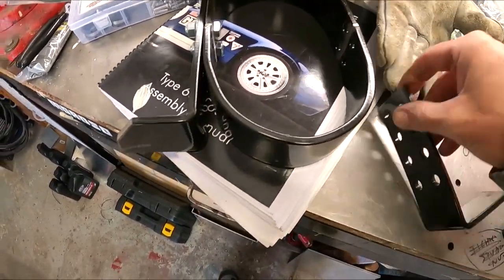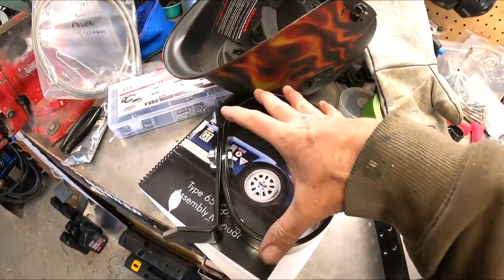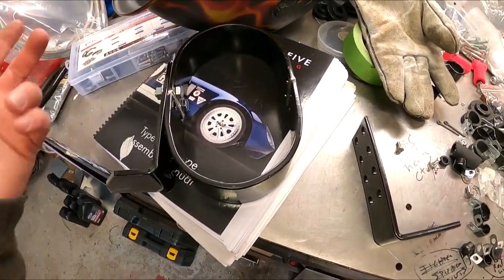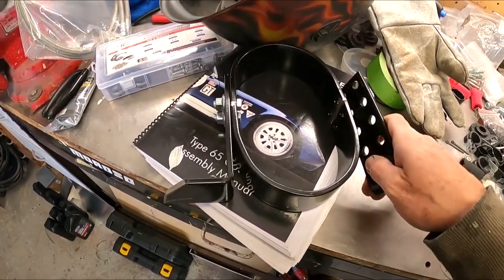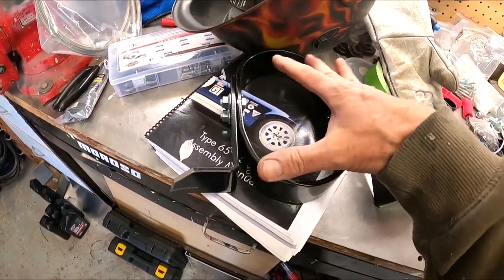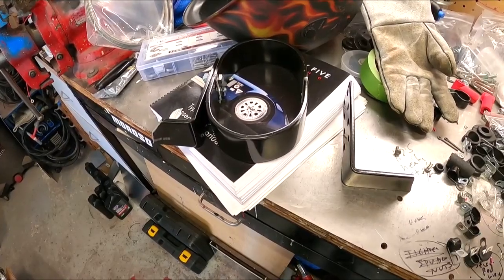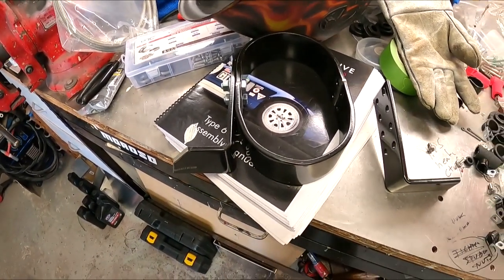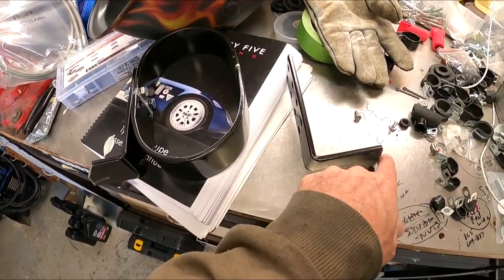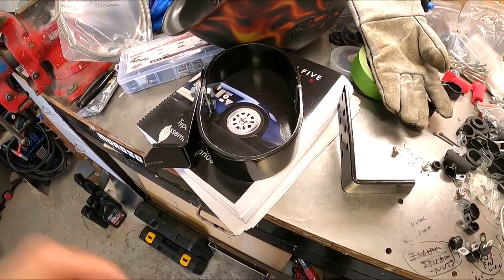The brackets are all done. I had to grind the two ends so they butt together — this thing narrows down this way, and I ground in between so the holes would line up. This is a generic unit, about $25 from Summit, thick steel. This piece bolts up here, then we weld the whole thing into the frame. That way I can still unbolt the loop and drop it out if I ever pull the transmission. I'm always thinking ahead. We'll get this thing C-clamped, clean up the metal edges, tack it in, then pull it back out to get inside and complete the welds.